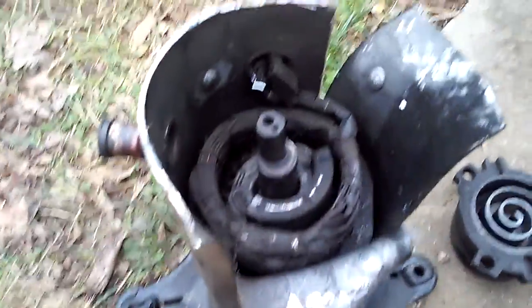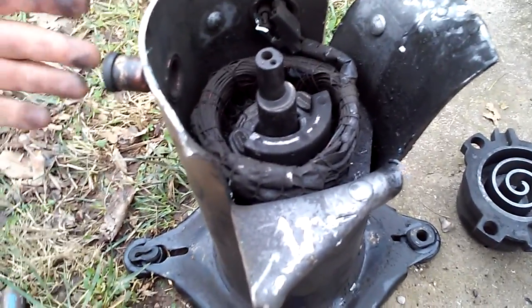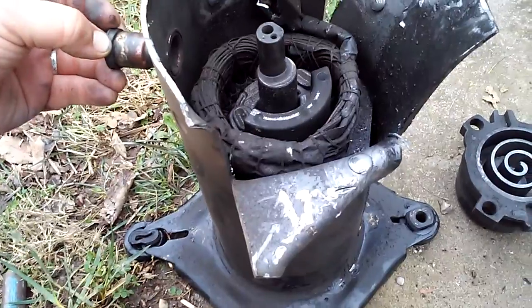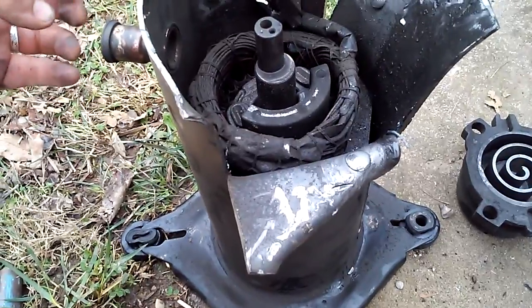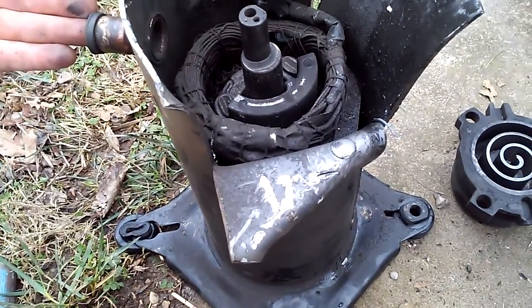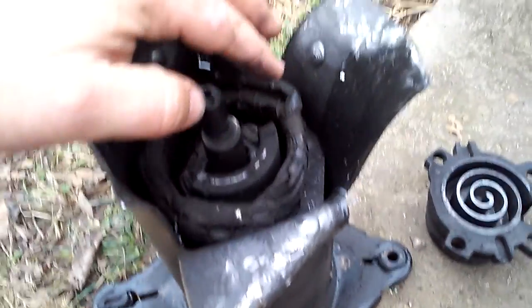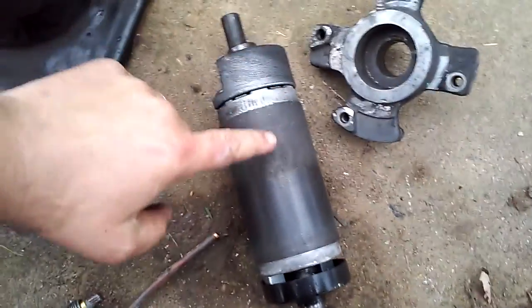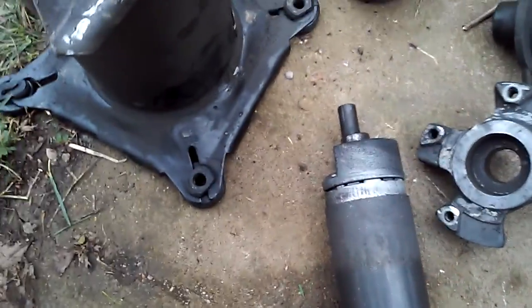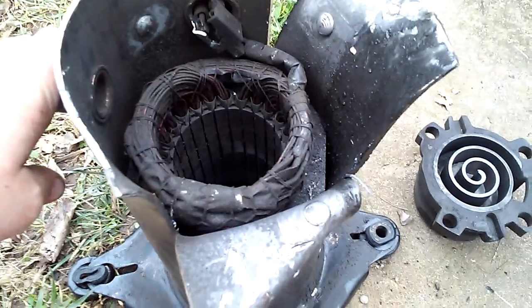The guy who did the install used soft solder at that steel valve and could never get it to seal properly. All of that solder was just melting down between the copper and the steel, and then once the compressor started up we had a lot of solder entering the suction cavity, essentially blowing all over the rotating assembly and grinding up all of the solder between the armature and the stator. This compressor was both locked up and shorted to ground as a result.